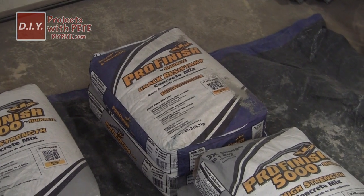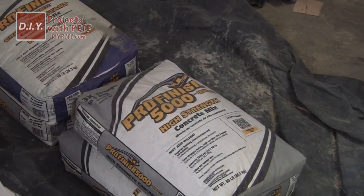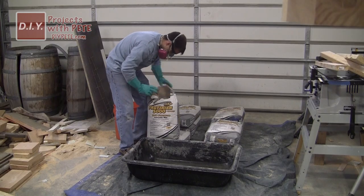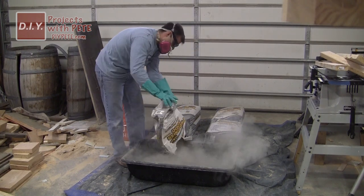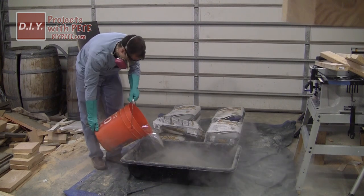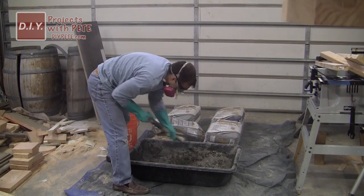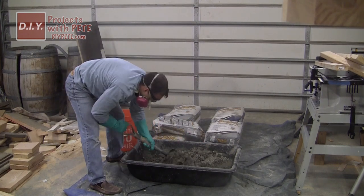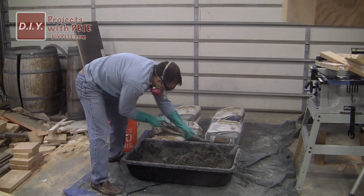I built a simple cart with wheels out of 2x4s and 4x4s to make it easier to move the concrete piece around inside and out of the garage during the finishing processes. Sand away the excess putty or spackle used to fill the nail holes, then clean the entire mold by vacuuming everything out and wiping things down with rubbing alcohol. Then draw a line one and a half inches up around the outside of the trough mold as a reference point for the concrete thickness. Now it's time to start mixing the concrete. I used Quickrete 5000 for the majority of the table. Make sure to always wear rubber gloves and a dust mask or respirator while mixing. Mix the concrete in a plastic tub to about a peanut butter consistency using a small shovel.